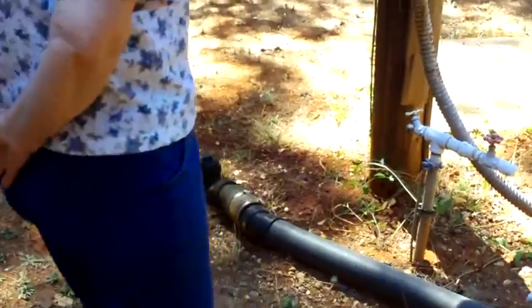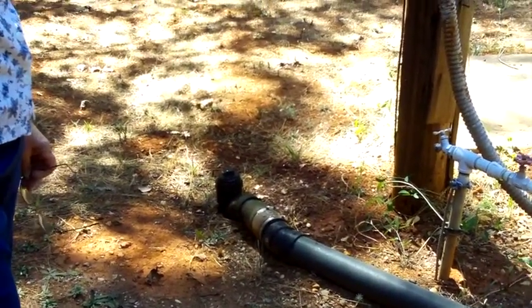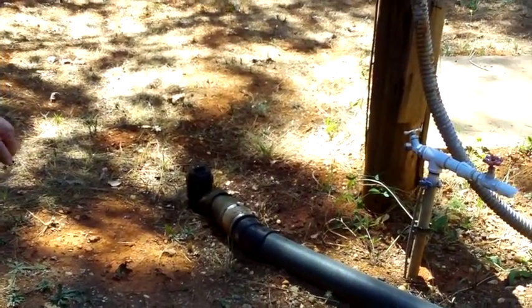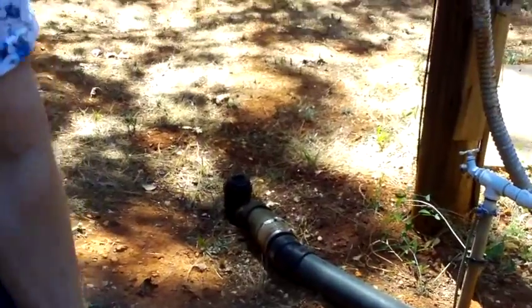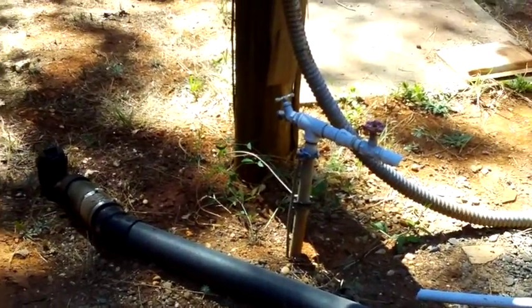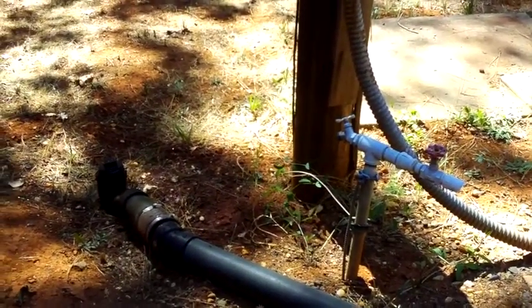That's the septic, this right here. That's the black line. Wow, above ground. That's okay? Not going to freeze? Well, the important part's underground. This line doesn't have water in it all the time. It only has water flowing through it when you are using the facilities. So nothing can freeze in there.